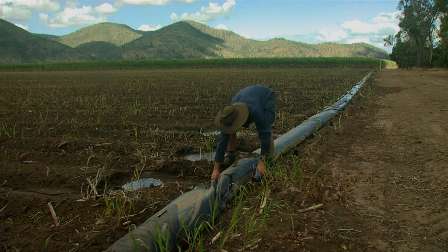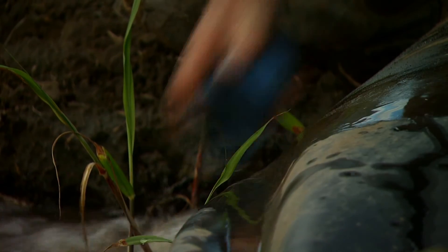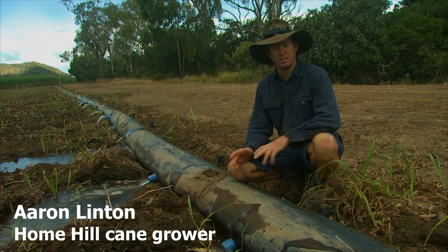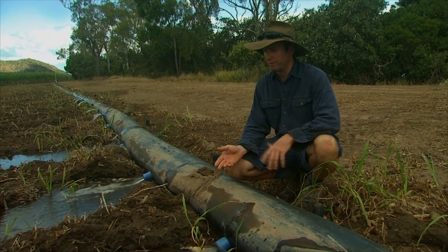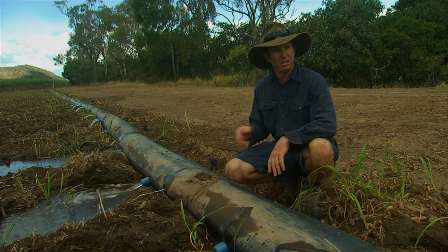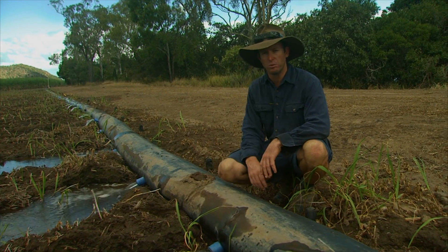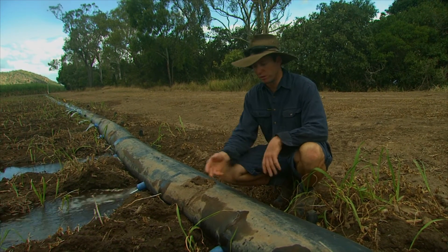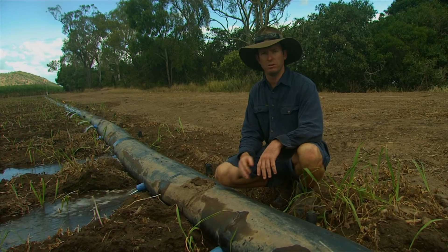The drip system also offers substantial labour cost savings when compared with furrow irrigation, as flooding cane fields is a time consuming and labour intensive process. With the drip, once it's all in and set up, it's basically set the program on the computer and it does its job. With flood irrigation, we have the plastic fluming — we have to come along and set up cups to adjust the flow rate down our furrows to suit each block. It can be quite labour intensive if we want to cultivate the paddock — we've got to remove all the cups, roll the fluming up, and knock our end banks down for anything we want to do in the paddock, otherwise we can damage it, especially for harvesting.